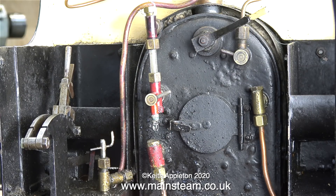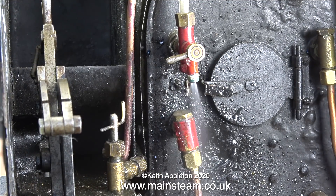The clack valve below the water gauge I'm going to change also because it's an old one. Old clack valves are made of brass — they can de-zincify and break. So I think I will pre-empt any problems by replacing the clack as well.